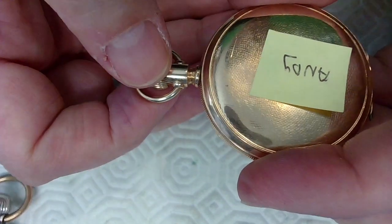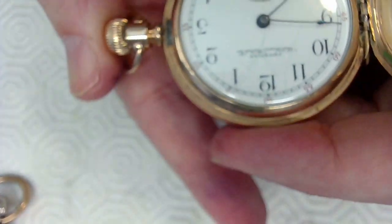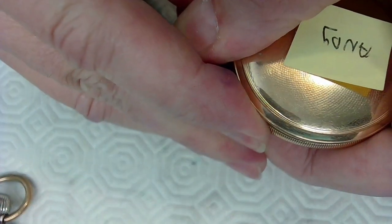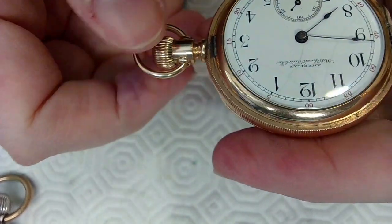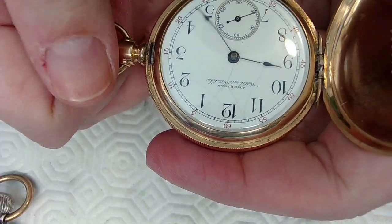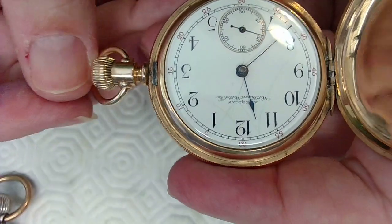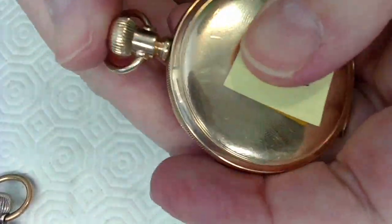So that, in this condition, I can set the watch, but stupid me, you got to open the lid first, right? Before you can prove that. So you can do it like that. Leave the lid open and loose when you do this. Move it out into the setting position. And if it doesn't crack right away, just move the crown a bit. And as you can see, now I can set the watch, right? So right now it is 11:38, like that. Then push that baby back and then close the lid like this, right?